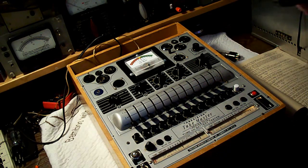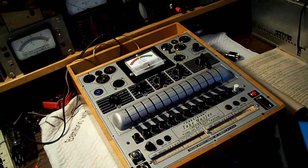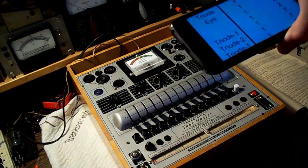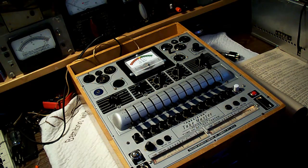The first thing I need is a copy of the roll chart — I have it on my phone here. I pulled up a PDF version of the roll chart because this is a supplementary chart; it's not on the one on the machine itself. So there are two tests: the first one is to test the actual triode section of the tube, and the second one is to test for brightness of the magic eye itself. We're going to go ahead and run through the triode portion first.